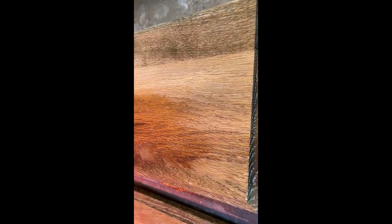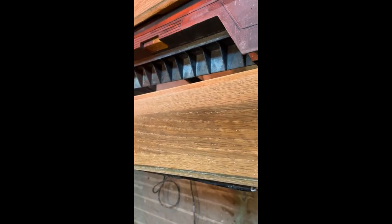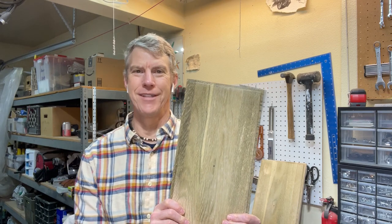What the heck? I thought the bleach was going to take the color out, not add a dark green to it. I made a big boo-boo — a dumb mistake. A mistake that I knew better, but because I was feeling impatient and for no real reason — I did not have any kind of time limit at all. But whenever you do something new, you should always test it first before you do it on all of your medium that you're working on. So I attempted to bleach out the red from my red oak and instead it turned green.